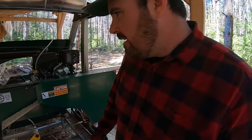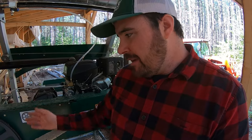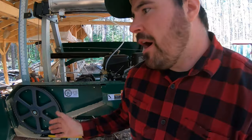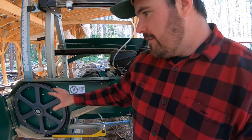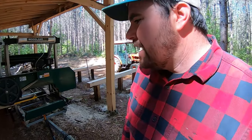If this blade comes off you're going to damage the blade, no question about it. At the very least you're going to have to resharpen the blade; potentially you'll have to reset the teeth and then sharpen it. Even worse, you might jump that blade off, cut this belt, and scratch up the inside of the housing. If you do even more damage, that blade's going to kink and now that blade's garbage. Last time I bought blades, including shipping and taxes, I'm at the better part of 30 Canadian per blade — you don't want to do that too often.